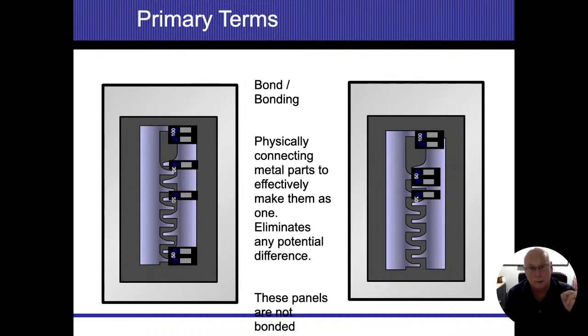So as soon as I have an energized conductor energize the case, it actually energizes all my plumbing system, all my conduits, all the cases, and everything else that has a ground plug that's plugged into any grounded outlet. All those items are instantly energized because I have one loose wire touching that. I'm hoping you can see how dangerous that is, and we need to turn that power off as fast as possible to keep everything safe.